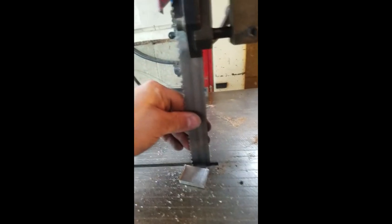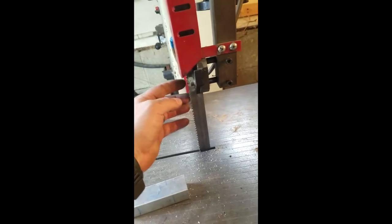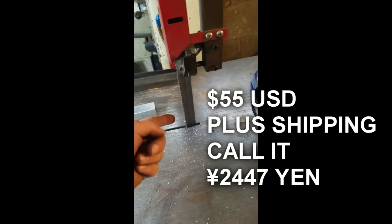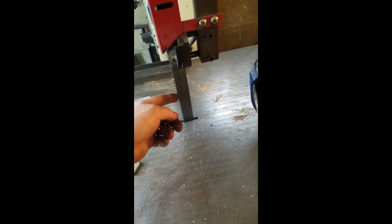So, I think today was an unmatched success in the life of our shop. I think if we spend a little time sharpening these teeth with a Dremel, I think we'll be good to go. So all in all, this took exactly 1 hour, and we saved this much money. And we've added capacity, and we learned that this thing can do a 1-inch blade just fine. So that opens up new possibilities for resawing wood if we ever do buy another blade.